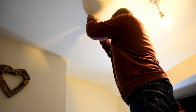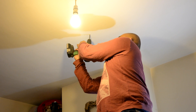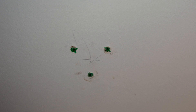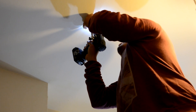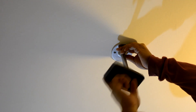Once you're happy with all of this, you can mark out the holes for the bracket. Make sure the bracket is perfectly aligned to the center of the screen. If you're happy that your holes are perfectly aligned, go ahead and drill them out. The raw plugs that came with this particular bracket were terrible — don't use them. Use hollow wall anchors instead, which are much stronger. Get those in and tighten the whole lot up, then install your projector.